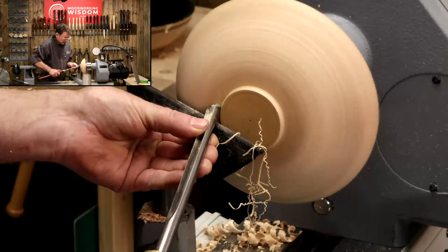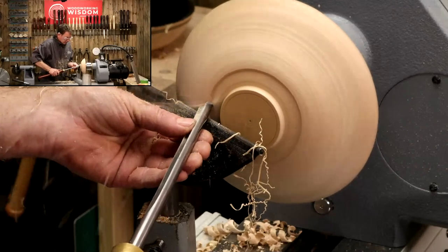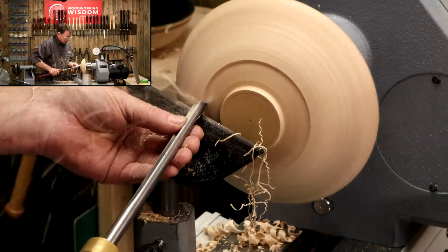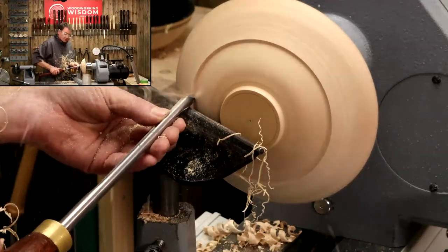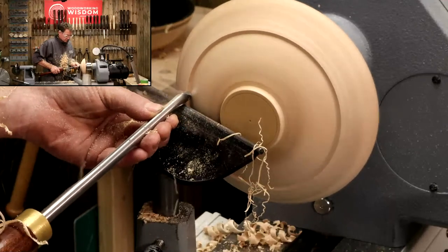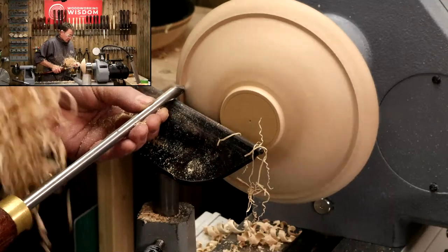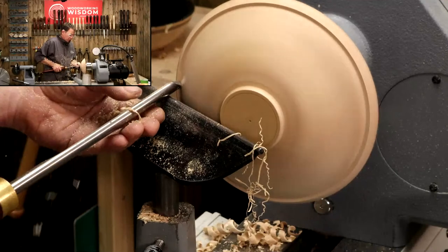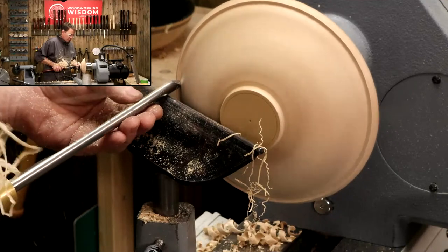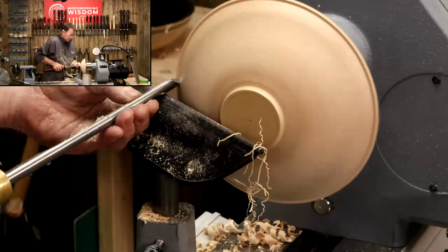We turn the gouge over, so we turn the clock. And we're going to drive out. So we're resting the bevel. Handle's coming round. So I've had to move the tailstock out of the way to get this one in. Gently pull it round. Not in a hurry. Just let the gouge feed itself. If I stop pushing with my handle, it stops. Little bit of pace. Nice and controlled.